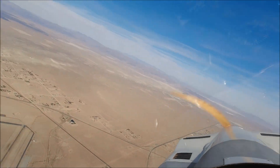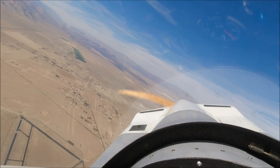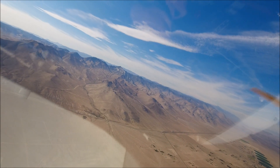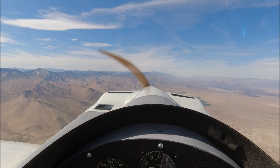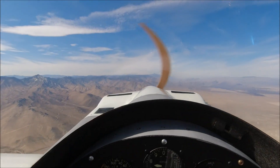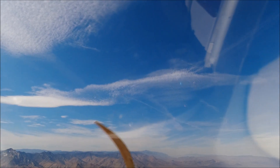We're back over the airport, heading east. Making a sweeping 90-degree turn over the airport to head north. At this point we're about 30 minutes into the flight, so I'm starting to think about heading back. But before I do, because of the new static system, I want to do a couple of power-off stalls to make sure I know where on my airspeed indicator the power-off stall occurs. From there, I'll multiply that number by 1.3 to get my approach speed. I had numbers for this already with the previous static system, but with a new configuration it's good to know where I stand so there aren't any surprises in the pattern.